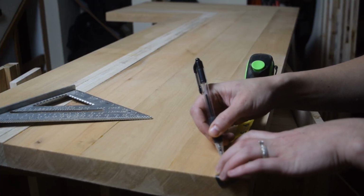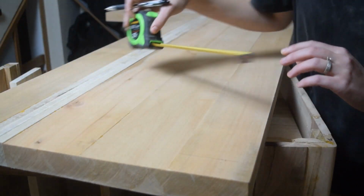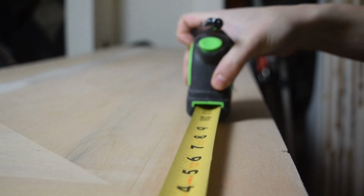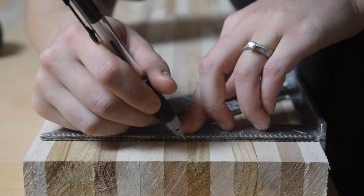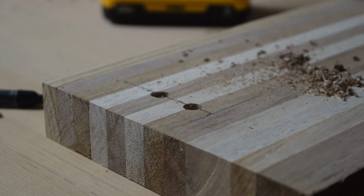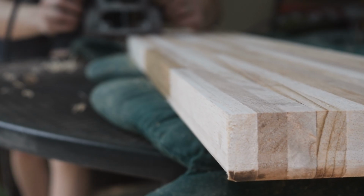With the miter glued, I flipped the countertop over and marked the placement for the countersinks. I did this before rounding over the edges to make for more precise measurements. I did the same for the upper countertop, making my marks on the upward face. Then, cut the sinks for the upper counter so I could give all of the exposed counter faces their round over and finishing level sand downs and not worry about erasing my marks.